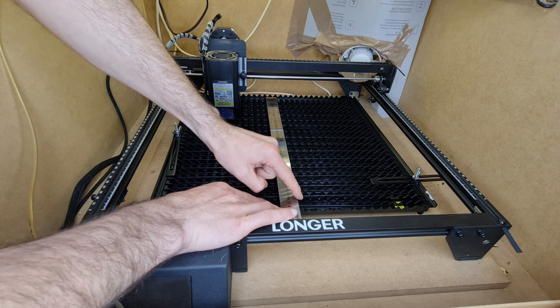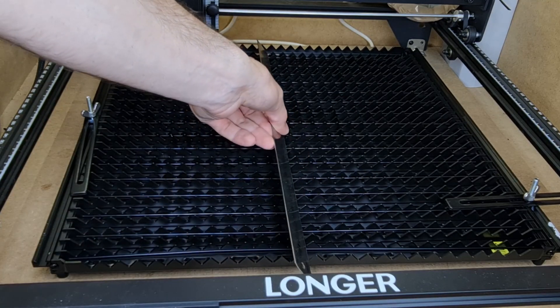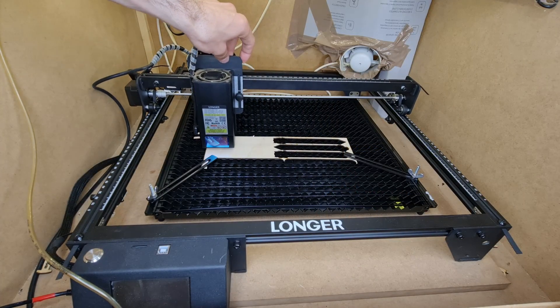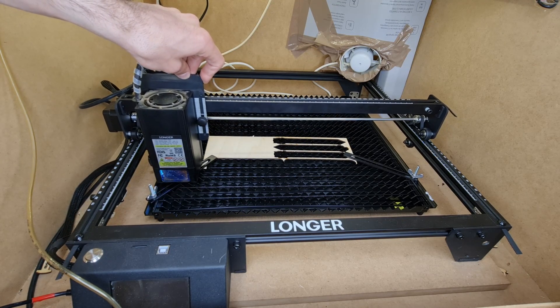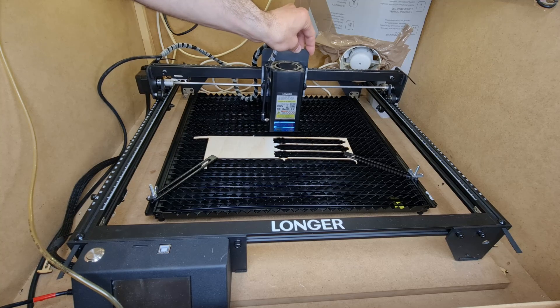A couple of things that I believe could be improved. One: it would have definitely helped if on alternate rows they had created blades with a half-pitch offset shift, so that in case your cutting goes on a straight line, it will only hit 50% of the crests — meaning 50% less dark spots under your material. The other thing is the clamping system. The clamping bolts are tall and can sometimes be in the way of your laser module. In fact, if you have one of the bolts closer to the homing area, it will most likely hit it. Of course you can shorten or trim them, but it would be nice to either move the bolts to the side or change the clamping system a little bit.